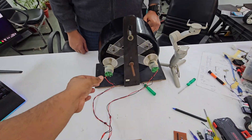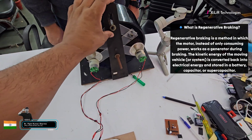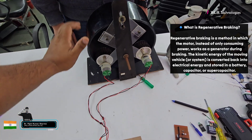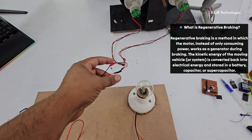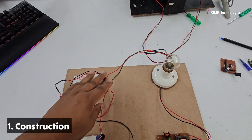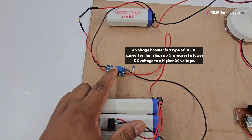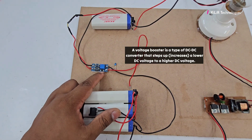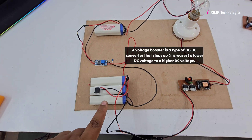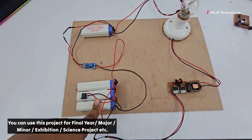This is our project and we have two motors here to regenerate the power when brake is applied. These are the wires connected to this LED which is showing that power is generated. After that we are charging this 4 volt battery, and then we are using one booster module which will boost the voltage to 15 volt — we can set it accordingly — and this 15 volt will charge this 12 volt battery.